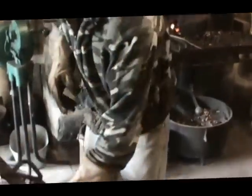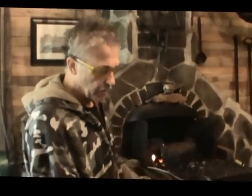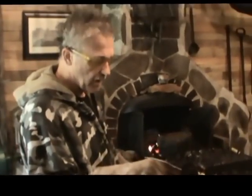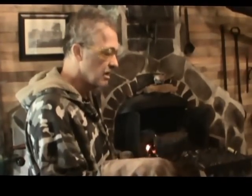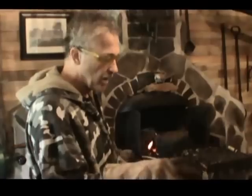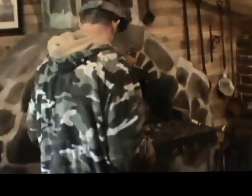If this doesn't work this time, we're going to have to let everything cool off and try it again in the morning. I've noticed that when I put the Babbitt right on the bottom, it seemed to stick to the cold plate better than it did the hot, because we tried to re-put the Babbitt right on while it was still hot. But we're going to find out in just a minute if this is going to work. If not, we'll redo it in the morning. But it's worth a second try while everything is warm. Here goes.